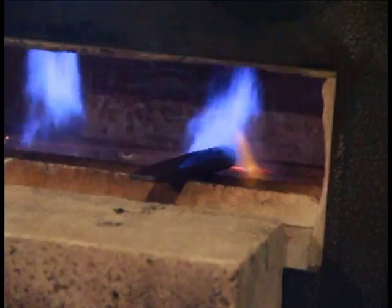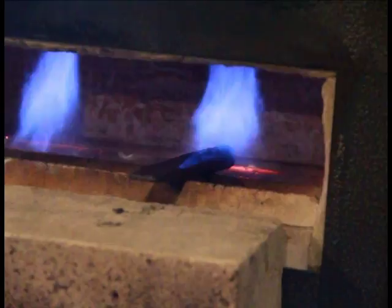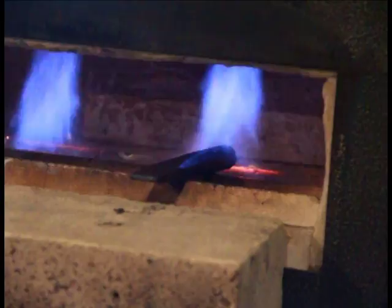We have cleaned off the section that was initially broken, but the metal that has not fractured yet but still has stress built up in it needs to be removed. So we're going to heat the steel up to a normalized state, just to the point at which a magnet no longer sticks, which will return the steel back to a normalized or softened state, and this will allow the piece to be used for quite a while.